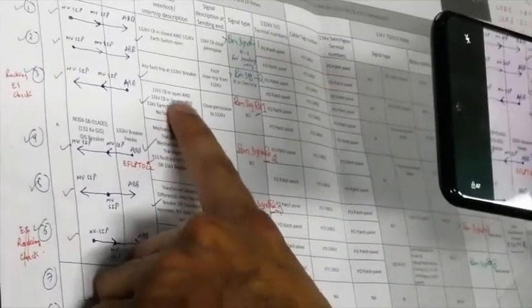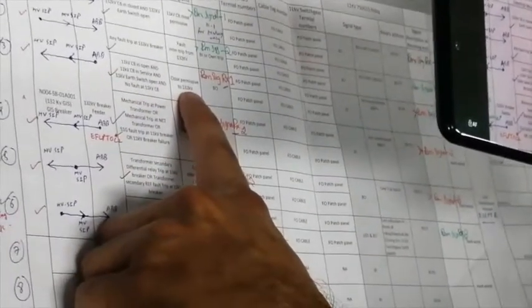So let's check on the 132 kV circuit breaker side. We have configured LED number 1 for this to check if these conditions are true on 11 kV. Then we should have a signal on the 132 kV permissive signal. So we have configured it on LED 1 of the 132 kV Siprotec relay. So let's check LED 1.